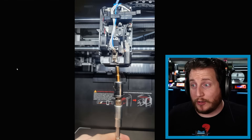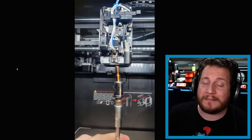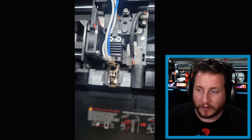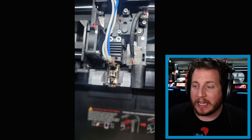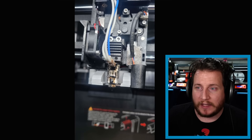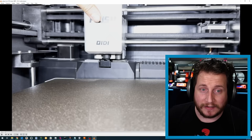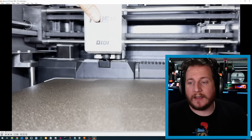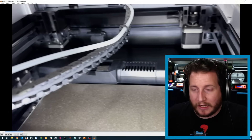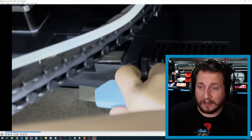I'm just going to completely remove that plate by forcing it down, but that shouldn't happen — especially not on a $20 nozzle. Chidi, we gotta do better. This is one of those things where it's like: oh you thought Revos were delicate, oh you thought Bamboos were delicate — this is literally made of ceramic. It doesn't bend, it just shatters. And now I had to deal with all this extra black PETG everywhere, even up into the areas of the heat break.